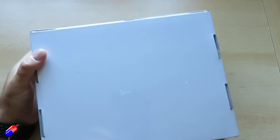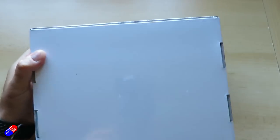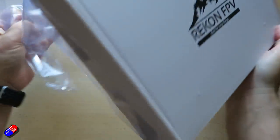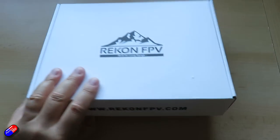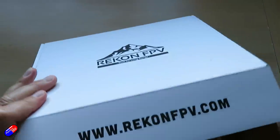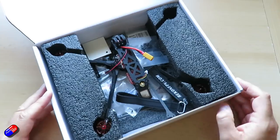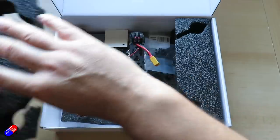It's basically the Recon 5 central body with a couple of tweaks — longer arms and some additional bracing. The flight controller in the middle is a Zeus F722 mini flight controller that will run on anything from 3 to 6S LiPo with lots of different BEC outputs. The ESC is a Zeus 28A BLS 3-to-6S capable 4-in-1 ESC underneath.